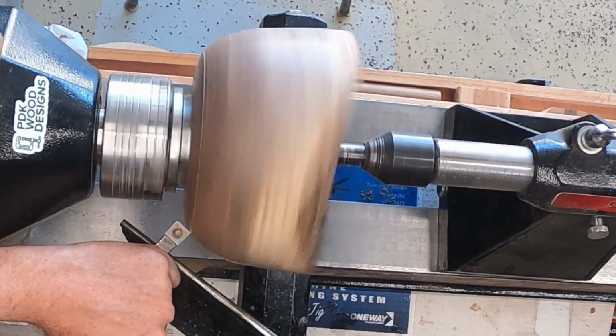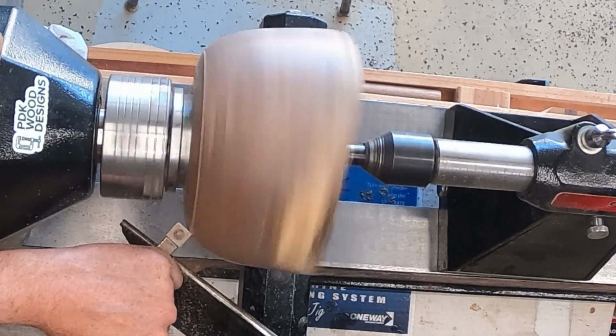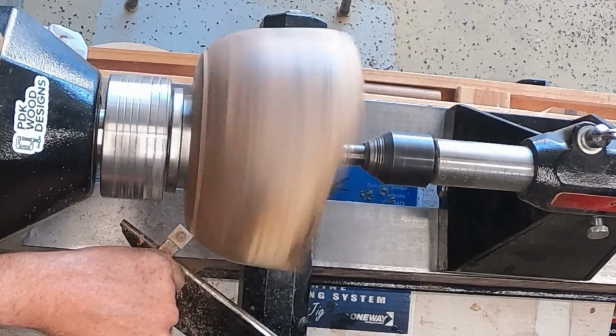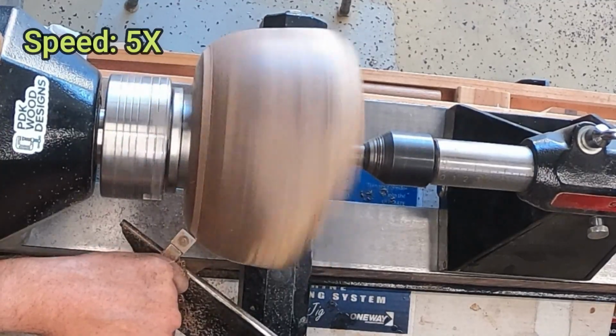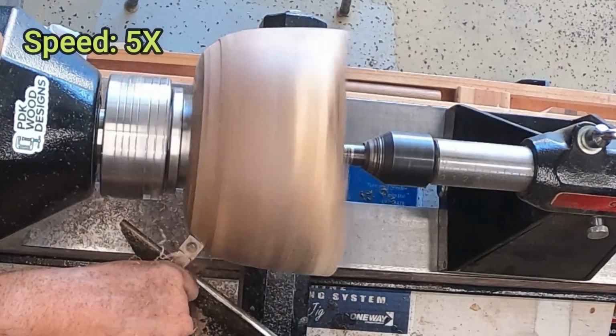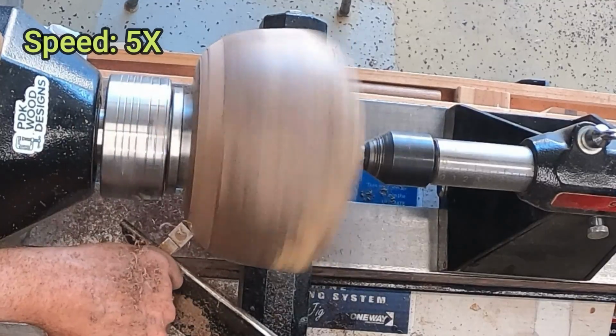Coming back to the piece the next day, it was apparent to nearly everyone in the lower 48 that the wood had dried pretty aggressively, leaving a couple of notable cracks. Off camera, we filled in the cracks with some sawdust and CA glue and let it set for a few minutes. We added a mortise, flipped the bowl around, and continued to work on the shape of the bottom of the bowl.